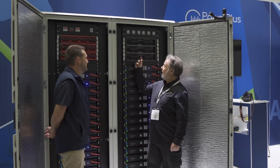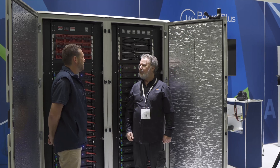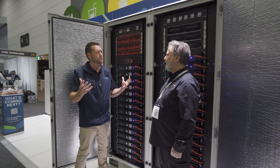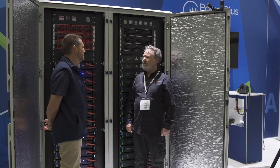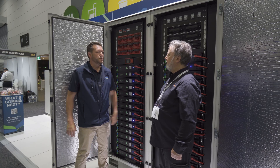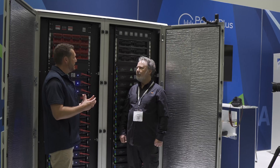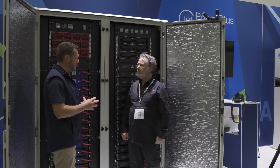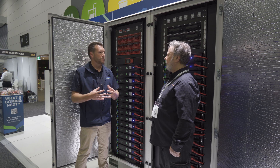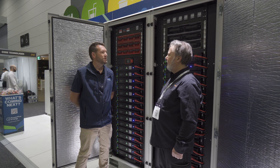For those who aren't familiar with AERL — these units here are the new rack mount ones. What's their maximum input voltage? Maximum input voltage is 600 volts, so you can go with your standard grid connect high string voltages, making it a very easy installation. As for monitoring, we've partnered with SwitchedIn on the monitoring platform. The first release is monitoring only, but throughout 2023 we'll be releasing alerts and emails. After that, we'll do performance monitoring where the system can tell you if there's a potential issue and give you pre-warnings to come and do some maintenance.